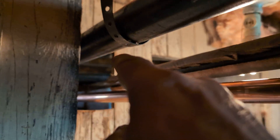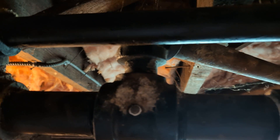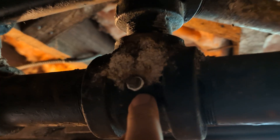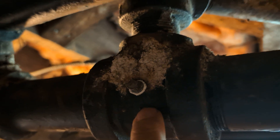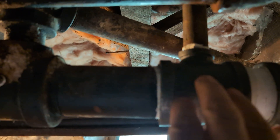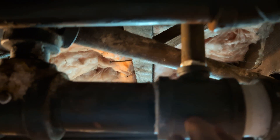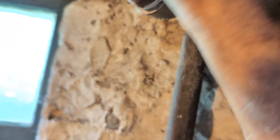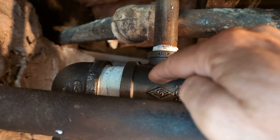Just a regular coupling, and then we have a 10-foot piece going to the end. It comes through here, and this is where the existing piping — probably the last of the existing piping — is. Frank had drilled this out and put a vent here, and had another fitting which he drilled out and put another vent. In this particular case, we cracked that off. This is existing pipe, and this is our new T — we're putting a vent stalk there.